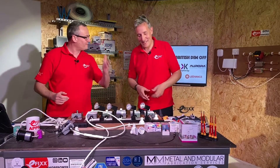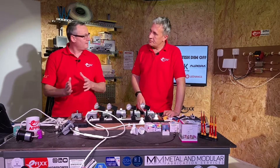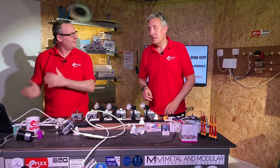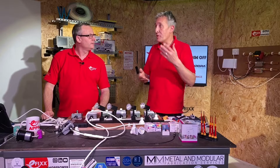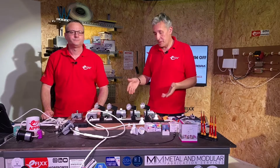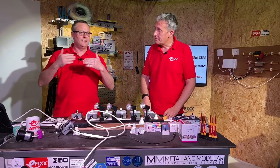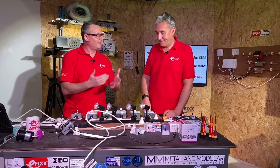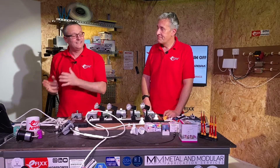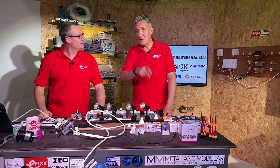That seems simpler the second time round once you've got your on/offs and ups and downs. Note: each lamp has a different low end. So if you were on an installation and suddenly decided to swap lamps, you'd probably have to reconfigure your dimmer. Classic scenario: maybe three or four lamps out of six have gone out, you replace all of them — if you haven't got exactly the same lamp you had before, you're probably going to have to go through the routine on the dimmer again.